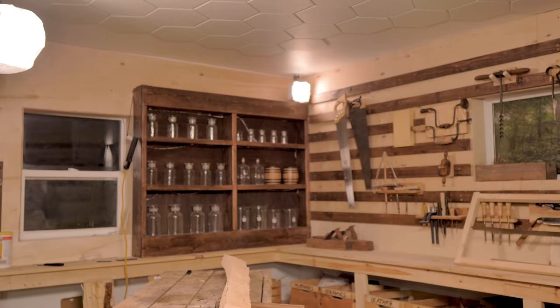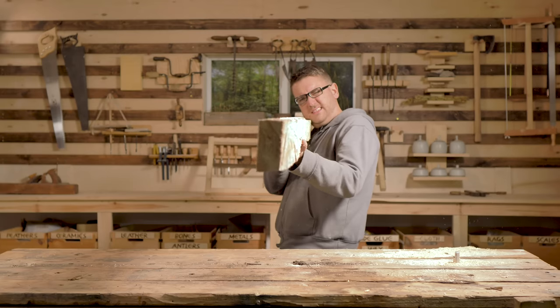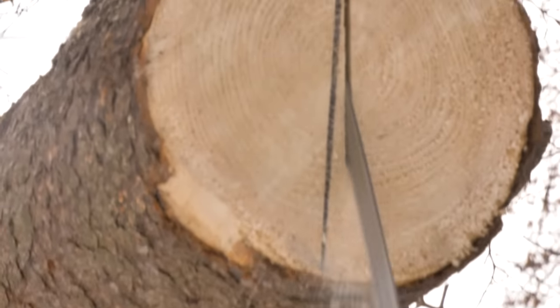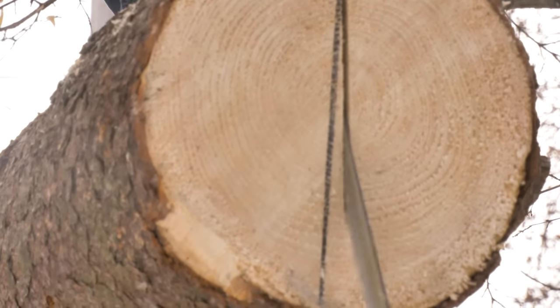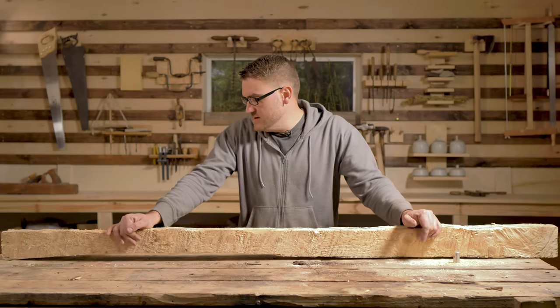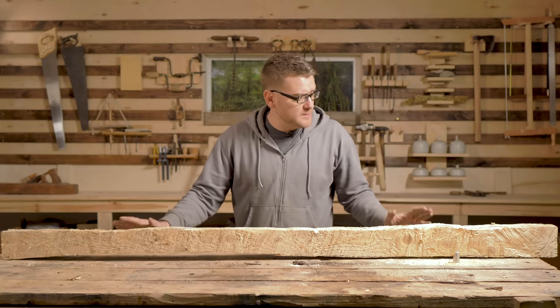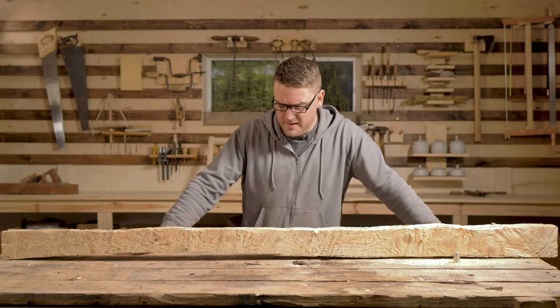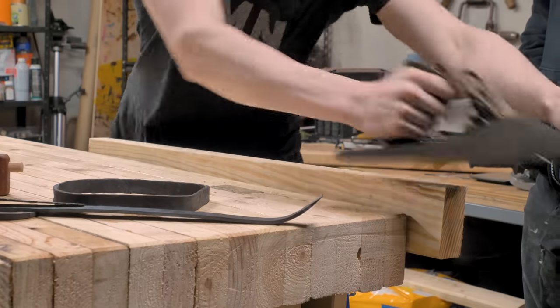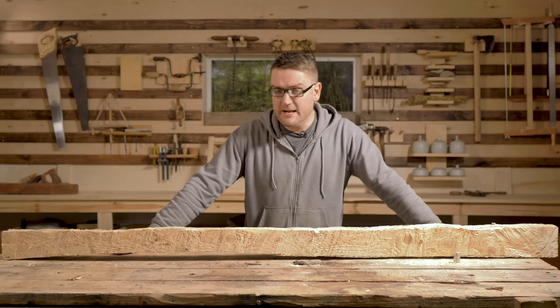After a lot of sawing to make all the cuts for a 2x4, it's a little crooked — not the straightest cuts, got a little bit of curve here and there, and not even all that square. Sawing by hand leaves a lot of room for random variability, and a big advantage of the sawmill is its consistent mechanical repetitive motion producing a consistent result. When hand sawing, if you get a little tired in one arm you're going to favor that and suddenly you're off — even an experienced sawyer's boards won't be spot-on. For fine woodworking where you actually want it perfectly straight and level, you'd finish it with a draw knife and hand planes.